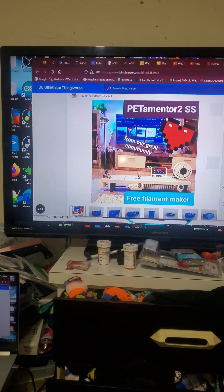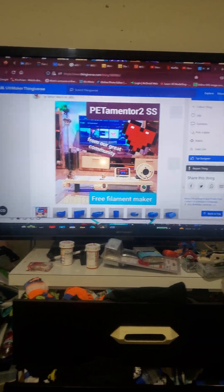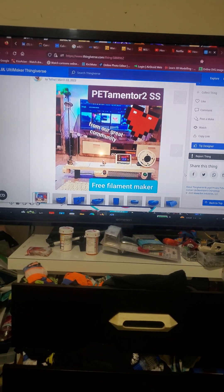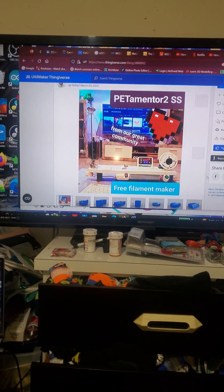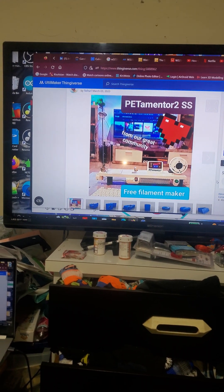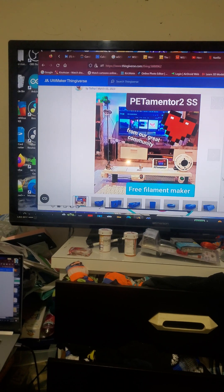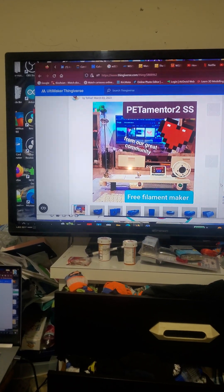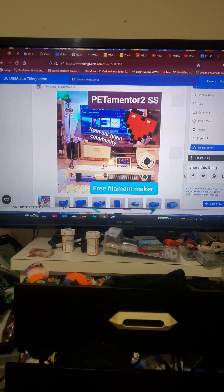So like a regular water bottle or any kind of soda bottle like Coca-Cola and stuff like that. On the far right he has a geared motor that pulls the filament he's making out of that bottle. He's using a nozzle like for a 3D printer — it has basically a 1.75 millimeter hole, and he used a screw drill bit to drill the hole wider than the 0.4 millimeter nozzle. Inside you can see he has a thermostat controller, so I looked online to find what kind of controller that was and I was able to buy it.